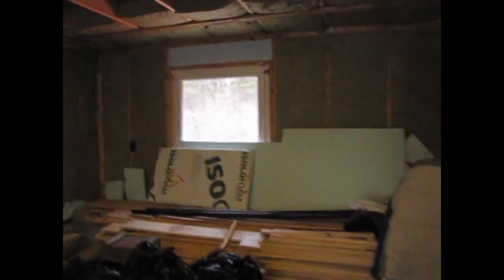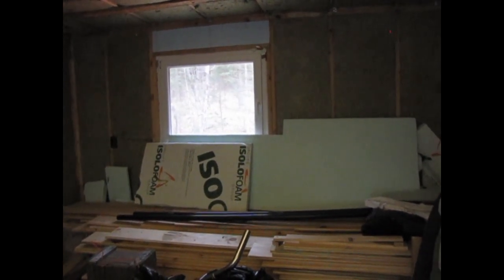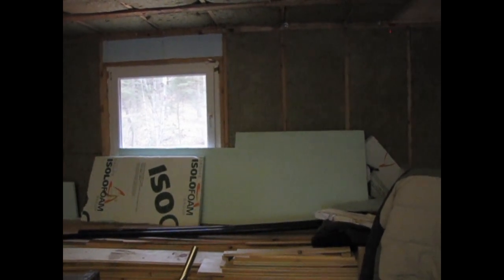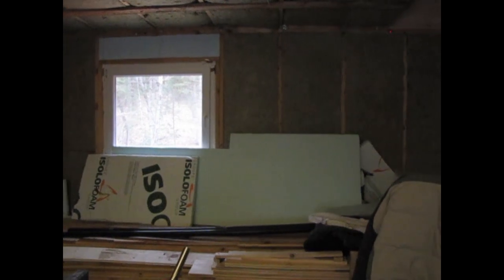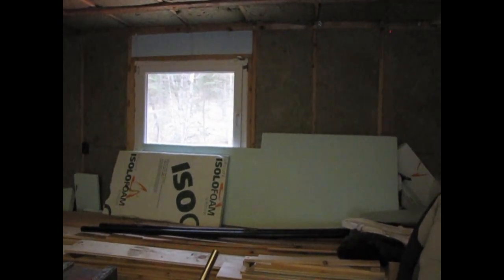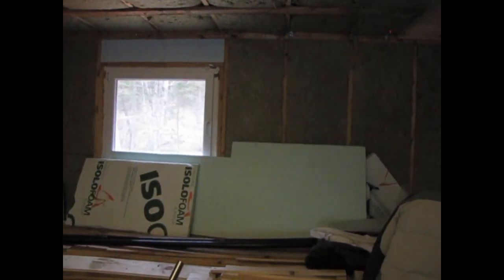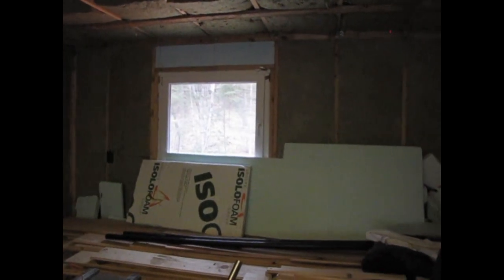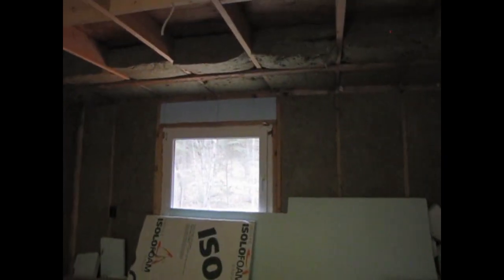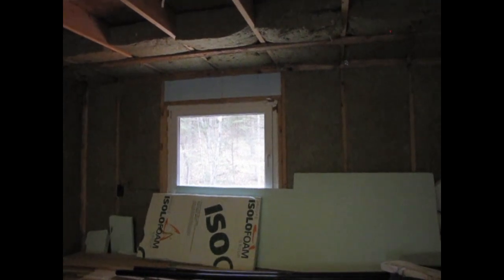In the kitchen I made the window wider than upstairs because we wanted it higher. I changed up the framing: instead of the standard two-by-six at two-foot centers, the two-foot center is actually the jack stud, and the king stud is to the right of it. So the insulation space on either side of the window is slightly less, but I can make the window wider or narrower — and height doesn't really matter.